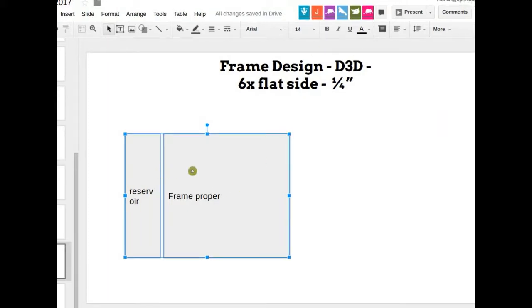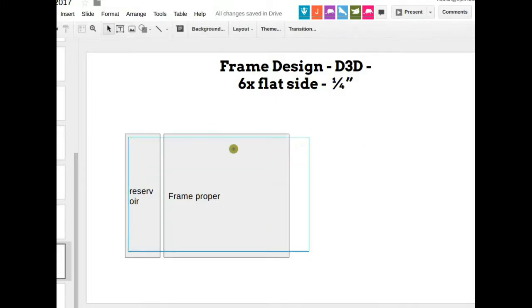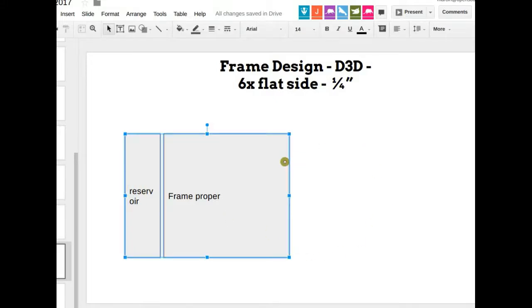But basically, if you do the flat CNC cutout, I would not do any bends here, because bends end up taking time. It's doable, but from my experience, it's probably easier to weld it than bend it, because after you bend it, you got to get it at a pretty exact angle to make it fit right, and that takes time. If you want to do a crap job, yeah, you can do it quick, but if you really want to do it fast, it's actually quicker to weld it than to bend it.